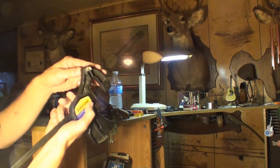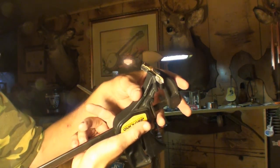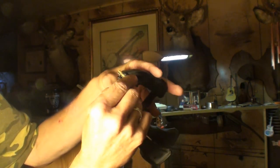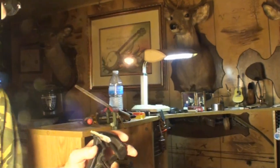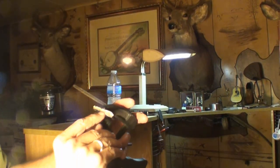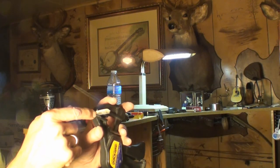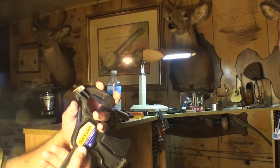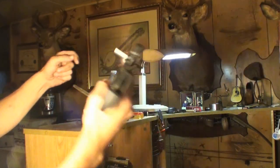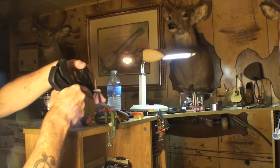to the clamp. I don't know if you can see that or not, but it's cutting a pretty good groove into it right there. In fact, that's just about good enough. Hold on. Okay, starting on the next one, you can see that one there I just did. I'm going to do this next one. I moved the clamp over, and I've got it clamped right exactly where I want the file to stop. So all I got to do now is put the clamp against the side of the file here.